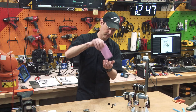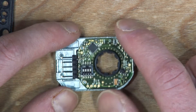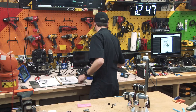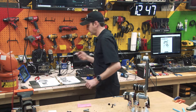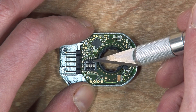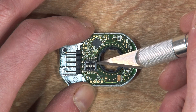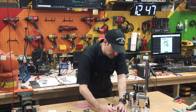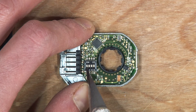And the actual encoder looks like this. Something important to note as you look at the encoder — let me get a little pointer. You'll see there's a little switch here and 'on' is up. You want to move three of those down. They're in order one, two, three, four and you want off, off, off, on. And what that does is sets your encoder to the right spacing.